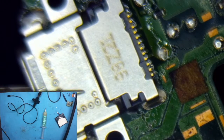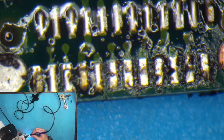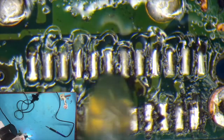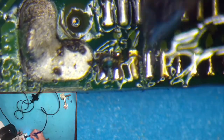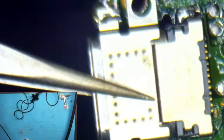I thought all was good, but I didn't check the USB-C port before I put it on, and sometimes from the factory they get little pieces of plastic. You might be able to see there in that shot. Not really, but there's little pieces of plastic that sometimes get lodged into the port, and unfortunately I didn't check it, so I put in the cord, and the piece of plastic lodges itself further and bends some pins, and bends the plastic out of the way itself too, which was glorious. So my last port went bye-bye.